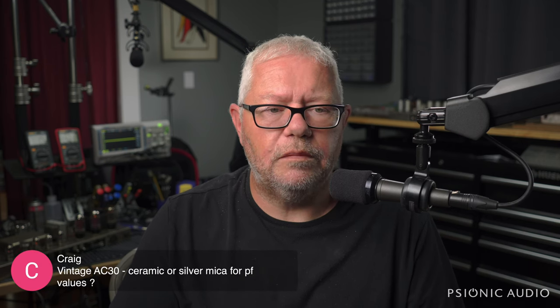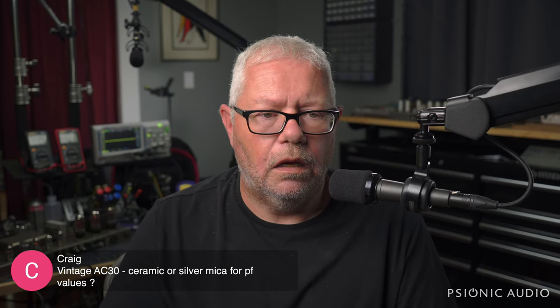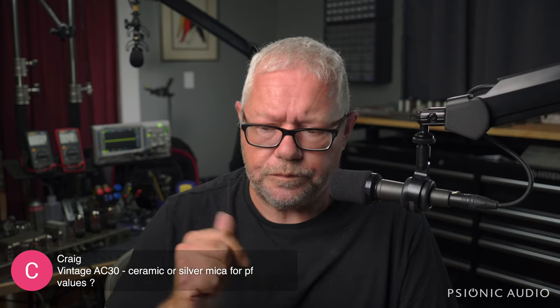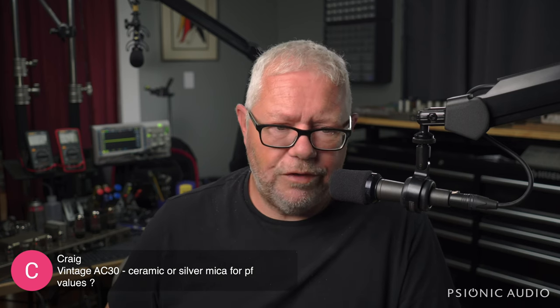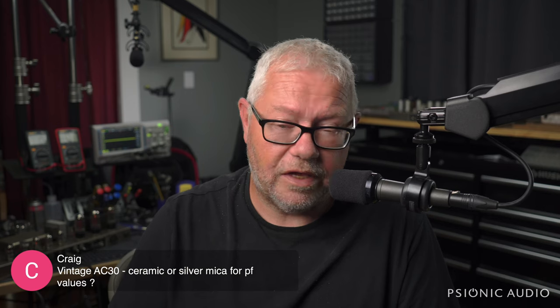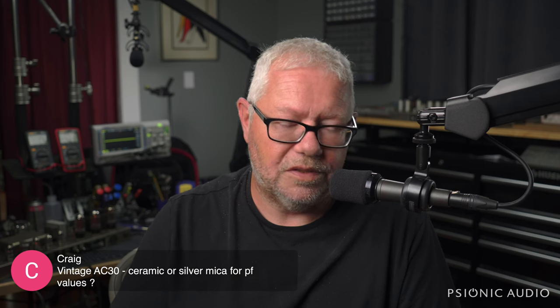Ceramic is what you'd find in most of the old ones. And ceramic, I like the sound of in an old AC30. The difference in sound between ceramic and silver mica can be relatively minor. So if there's a weird value, like there's a 750 picofarad in the tremolo circuit on the AC30, if you can't find the value in a silver mica and you get a ceramic, you won't hear any difference, or vice versa. So sometimes you find the cap with the value and voltage rating, and you don't worry about what it is as long as it's not leaking.